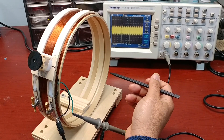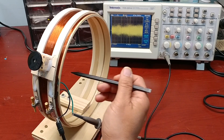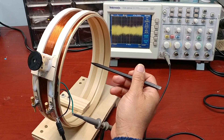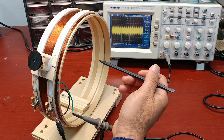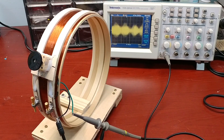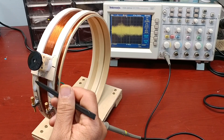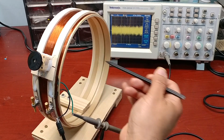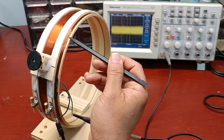In summary, the magnetic field from the radio signal is very weak. However, if the magnetic field frequency is the same as the natural frequency of the LC tune circuit, the magnetic field can cause the LC tune circuit to resonate. When resonating, there is high energy transfer between the coil and the capacitor, and that also amplifies the magnetic field inside the coil, which induces a voltage on the coil.